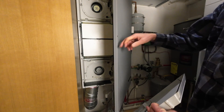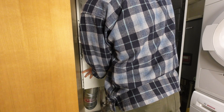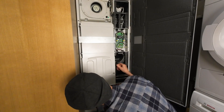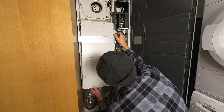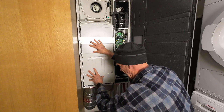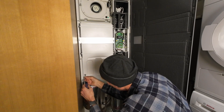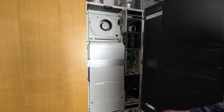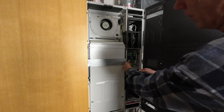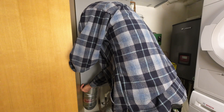We're going to put our panel back on. In my case it dumped out some water, but not too much. There are little keyways on the sides that you'll want to coordinate to push the exchanger all the way in. Then there are the two lower screws. When you're putting the cover back on, there are two holes — one in the center of the panel and one offset from the center. The first ones that hold just the inner cover go in the offset holes. The center holes are used by the outer door to close it up. Then go ahead and put in the six outer screws to close up the outer door.